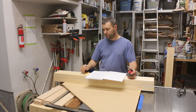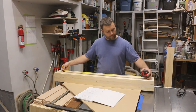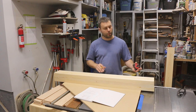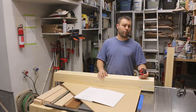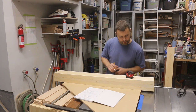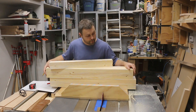To cut these feet, I want them to be 38 inches long with lots of room to play with. I'm going to trim at least two inches off each end for planer snipe. I'll trim one end using the panel sled on the table saw, flip it over because the blade won't go this high, mark at 38 inches and trim the other end. The two feet base cuts are done to length — they're not exactly the same length but we'll correct for that later.